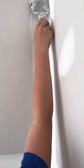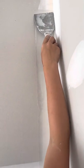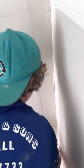Okay, now we're going to smooth it out one more time and we're not going to push it real hard. Okay, now he's going to have to smooth it out again. You'll see where he's laying his hand down — now he's digging into the other side because he's pushing too hard. This is something that rookies have a hard time with — it's not easy. You really got to get the feel for it. Put your finger up on the blade, don't put any more mud on there, let the knife do the work. See, he dug into the other side right there — go ahead and pull back up from the bottom, nice and easy, steady.